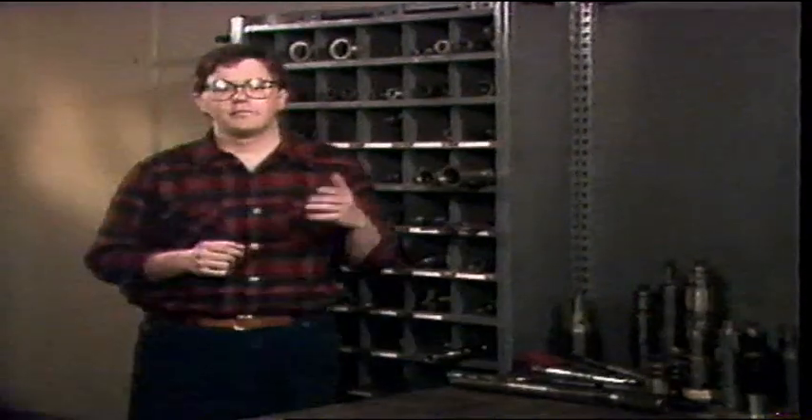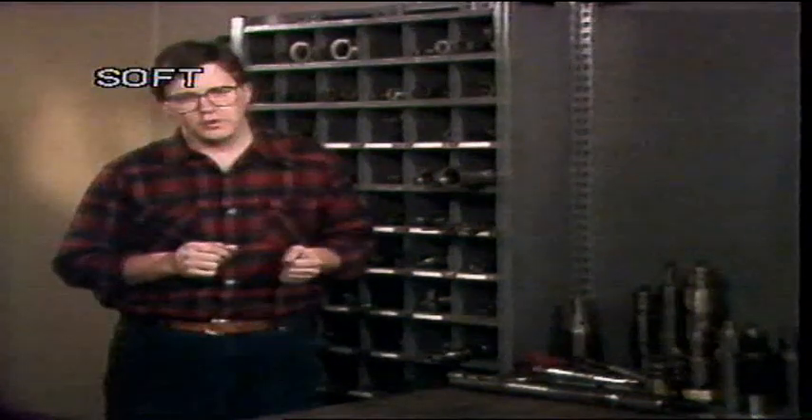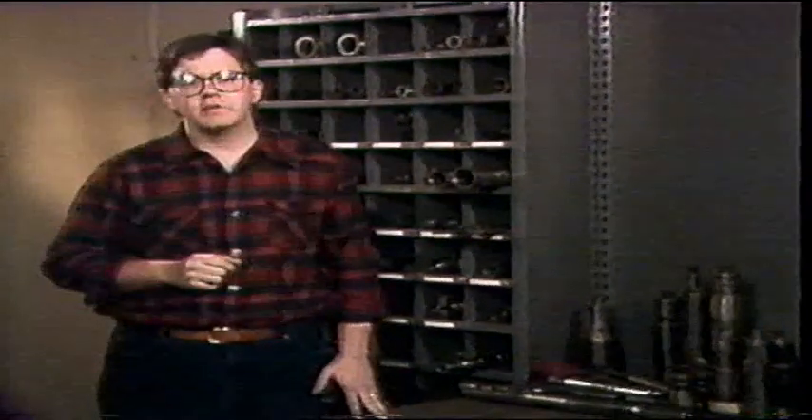Producing oil and gas wells have two conflicting characteristics which challenge engineers. The tubing and completion equipment, which connects the formation to the surface, is generally difficult to alter once installed. But the range and severity of producing conditions during the life of a well practically guarantee the need to replace or repair that equipment. Wireline operations permit repairs or revisions to the subsurface completion without removal of the tubing, particularly at offshore locations. Wireline also permits routine data gathering and sampling activities and generally provides a means of physical contact between the operator and the distant subsurface.